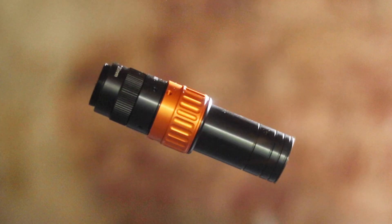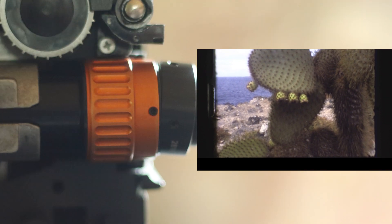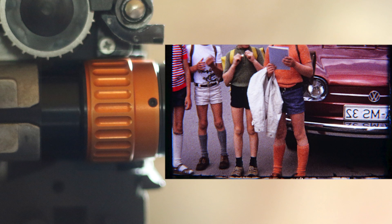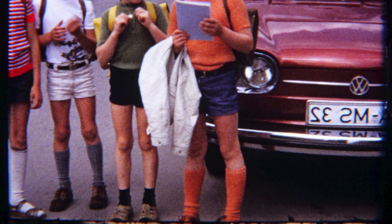The most important component of FilmDigital equipment is the lens, which includes a C-mount ring for horizontal and vertical alignment of the image, and a focus ring for very fine adjustment of the focus. The rough focus is adjusted beforehand by moving the lens back and forth in the optics slot.